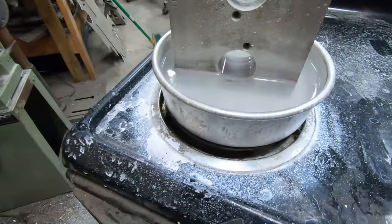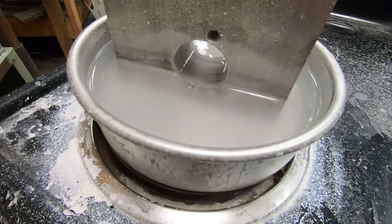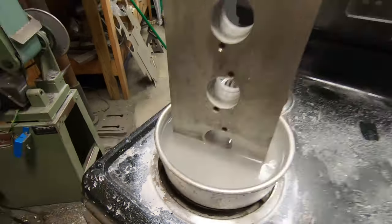And we're started up again with the alum water solution in the block of aluminum. So still warming up. You can see some bubbles coming out of the hole currently. So the reaction is happening again. And now the waiting game begins. So let's hope that this doesn't take all day, but if it does, it does. So lesson learned not to break taps off, but it is what it is. So I'll update you guys in a little bit with whatever progress happens.